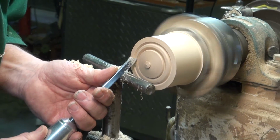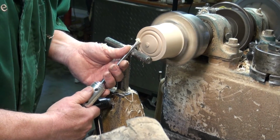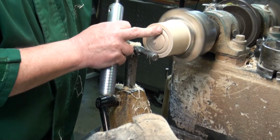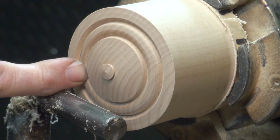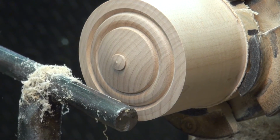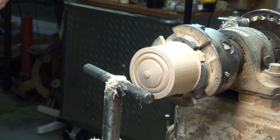It's kind of scary when you look at it, but pretty hard to get a catch with it, because you're taking so little wood. And after you get the base part of a bead done, you just want to take off a little bit of wood. There's not a whole lot to take off. You can kind of see what that does there. What I use this for is if I'm going to make beads that either increase or decrease in size. In other words, if they get bigger here, smaller here, I'm going to show you that on a little platter I got right here.